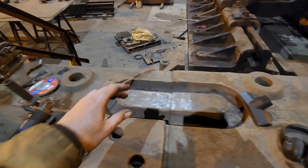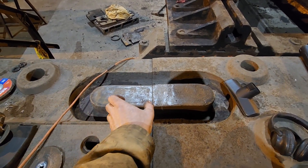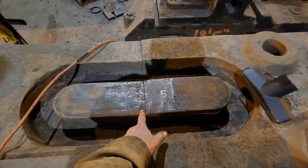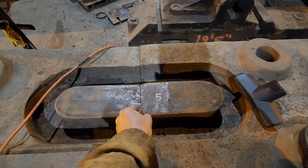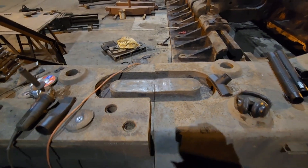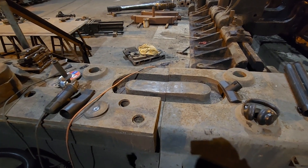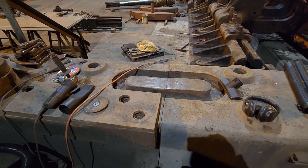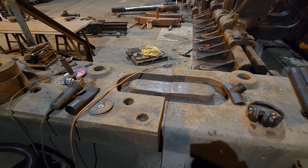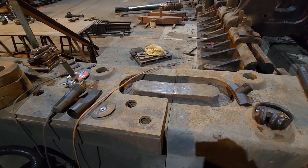Then you can take it and it'll just drop right in place here, and then as it cools down it'll squeeze itself together. It'll squeeze this joint together as tight as can be, and it's in there for all eternity until you heat it up and try to pull it back out. This is how this engine was put together, and it's also how the flywheel halves on the Todd engine are put together.